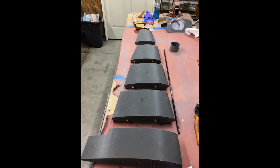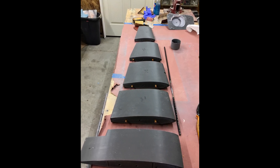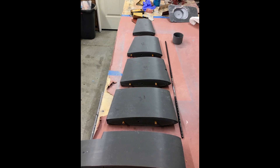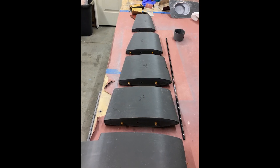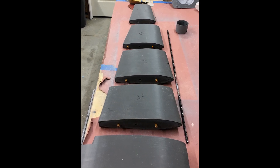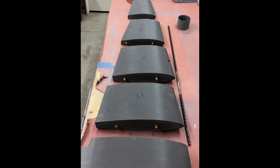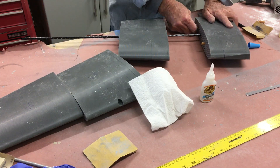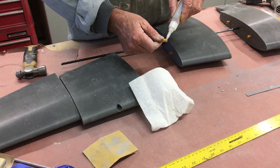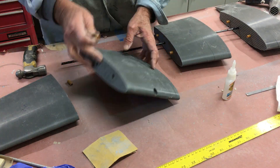These are all the parts we need to do the plug. You've got the five pieces which are the 3D printed parts, a bunch of little pins to key them all together, and a carbon fiber arrow on the right which is to hold it all straight. First thing we need to do is put the carbon arrow through the hole in the first part, then add the alignment pins.